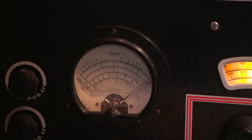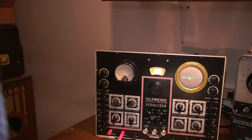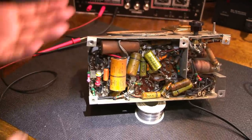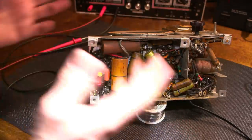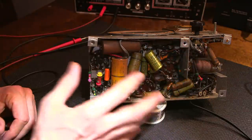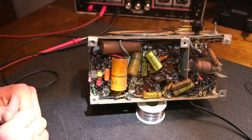No problems. So all in all, the resistors in this radio receiver, if I go through all of them, just focus down here on the chassis, most of the resistors in here are very, very close to their spec. And when they go down a little bit, I'm not too concerned about it. It's when they really start to climb high that it's an issue. And they all test very, very good. So I've gone through and tested every single resistor before this, just to get a good idea whether I'm going to have to change any of these things out. And they all look like they can stay.